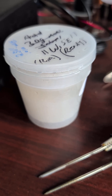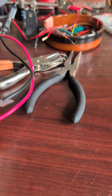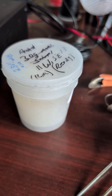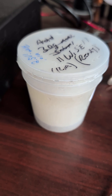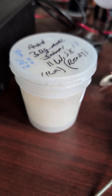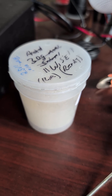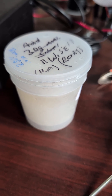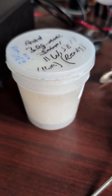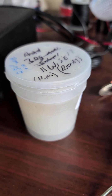There will be advanced methods for determining this, but if you're a home researcher or undergrad, just by putting these electrodes in that solution you'll be able to see if you're getting any hydrogen or oxygen gas production. The ceiling for this would be about 2.5 volts; I'll probably stay around 2.0 volts. With sodium chloride in water, putting overpotential to the side, at 1.3 volts you're going to get electrolysis of water producing hydrogen and oxygen gases — which I don't want in the supercaps. But I really am sold on the WISE electrolytes.